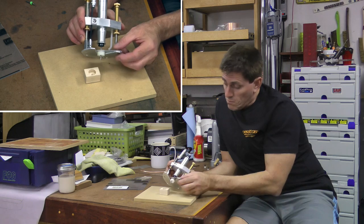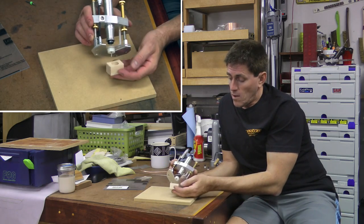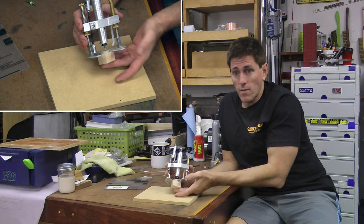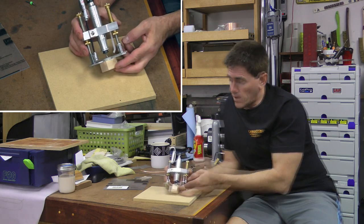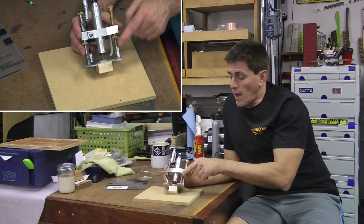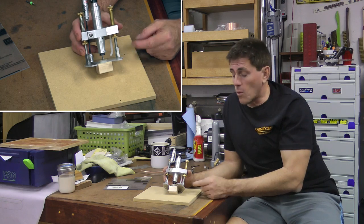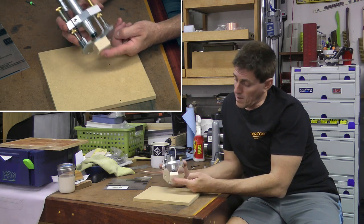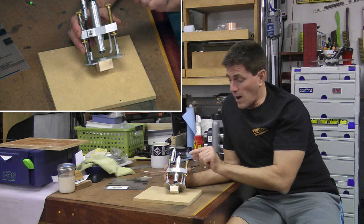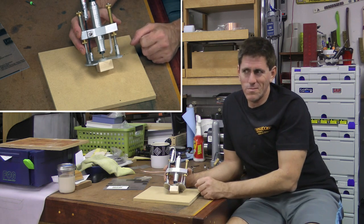The piece of Lexan and the nylon guide bushing would just be floating around with no way of centering them. So you take this jig, put it onto the drill bit, and as you push it up, you can place the nylon spacer directly into the three-quarter-inch hole in the maple block — and now it's perfectly centered. Another benefit: if you accidentally screw down one side further, the Lexan ends up not parallel to the base, meaning the bit isn't perpendicular. That's very hard to see and hard to test. But with this maple block, you can push it up on the bit and clearly see whether it's touching flat all the way across the base. Earlier I had one of these canted and you could see a gap on one side — unfortunately I'd already drilled a couple of holes that way, so I had to make them a little bit bigger.